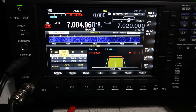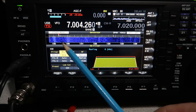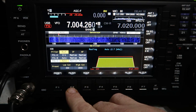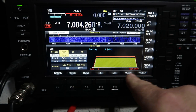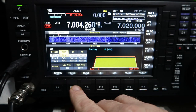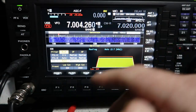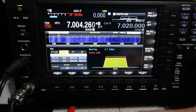For the SSB filters - I don't use SSB very much - I've got filter A set up as a 6 kHz roofing filter and the others left to default. Cycling through the filters you can see the differences: low and high cut from 0 to 5000 Hz - wide open for WSJT mode like FT8. Filter 2 is more likely for a standard SSB conversation. Filter 3 has some low cut in it. It's all configurable, set it up how you want, and it's remembered by mode.